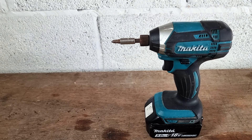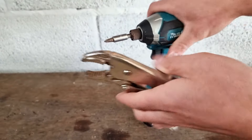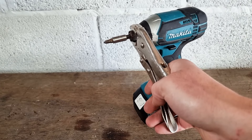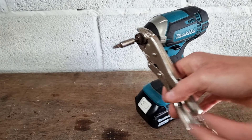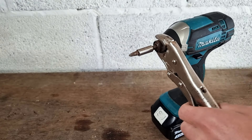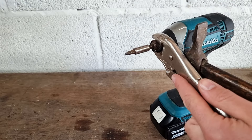So you can spray it with WD-40 and leave it overnight. Or if you're really struggling and you want to solve the problem quicker, you can get a pair of trusty mole grips — these are extremely handy. If you just clamp that around the collar there, it gives you a bit of extra grip strength. And then if you just tap it lightly with a hammer, that can sometimes be enough to bring this collar forward to free your bit.